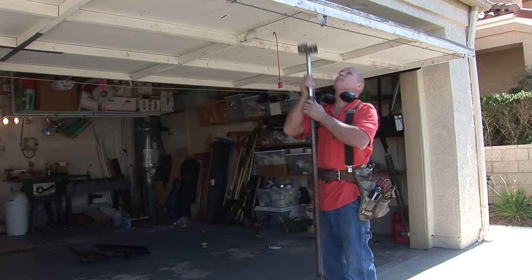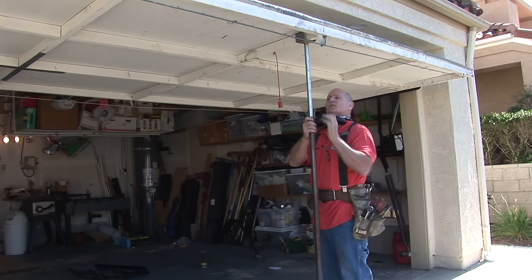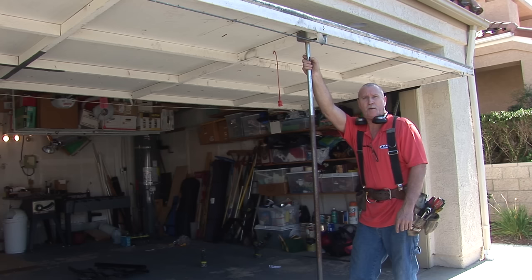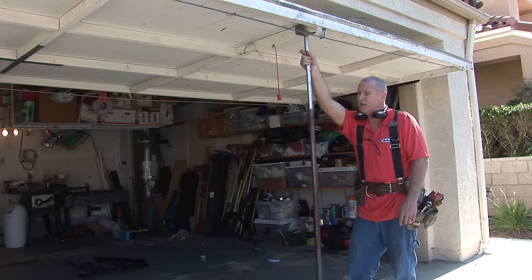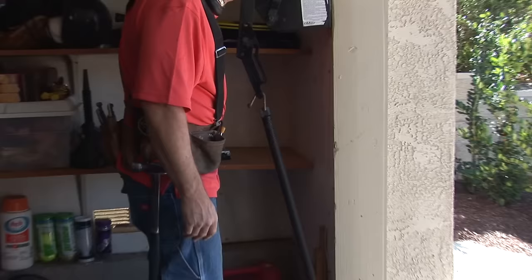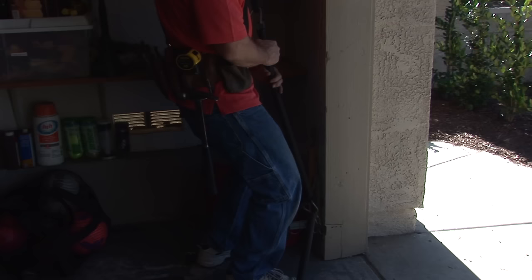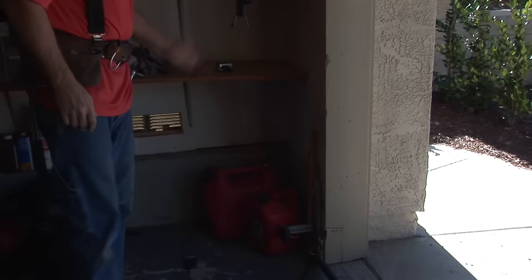The first thing you want to do when you are going to do a hardware job is prop the door up. I have a stand I use particularly for this purpose — you can use a 2x4, you can use a 6-foot ladder. Various ways to prop the door open, but just make sure that when you prop it open it is solid, because you are going to take the springs off and the door is going to get very heavy. You don't want them crashing back down. Taking the springs off can be pretty simple: grab the spring, pin your elbows to your side, bend your knees, grip the springs, and then simply stand up. If everything cooperates it will come right off. Get both sides and you can lower the door down.